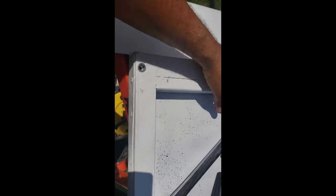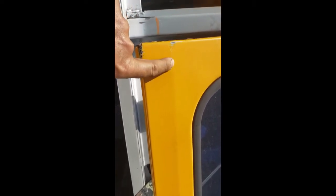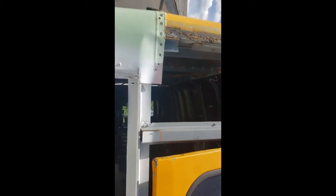Okay, so I've got these 4 rivet nuts installed at the top edge of the hatch. Next up, I'm gonna finish cutting these hat channel caps for the angle. It's got to kind of bow in a little bit, bend in a little bit. You can see a faint line at the top of the window. There's a bit of a bend at the bottom of the window. And then similarly, these panels here that are going to go in, those empty spaces will have a little bend in them. But first we've got to cut this out a little bit and tab that down.